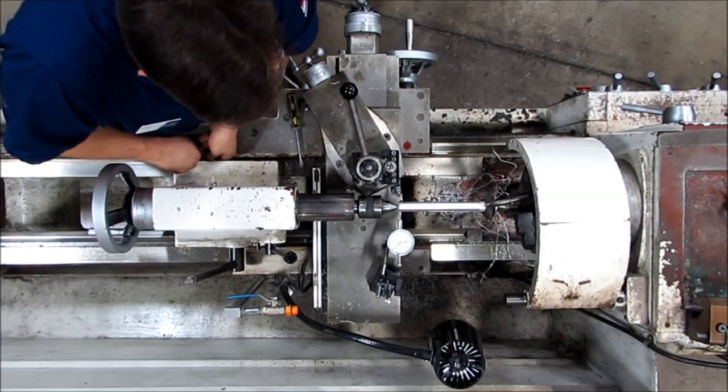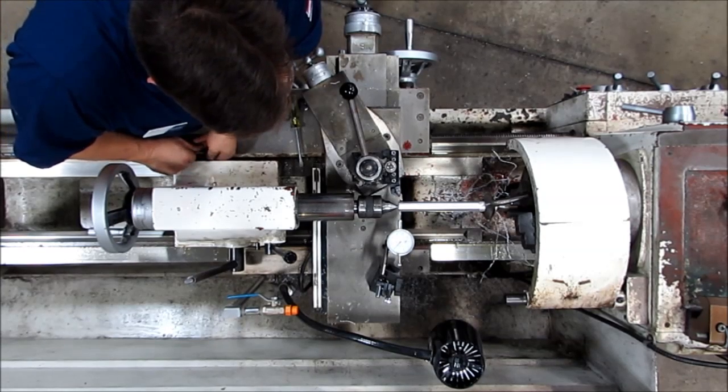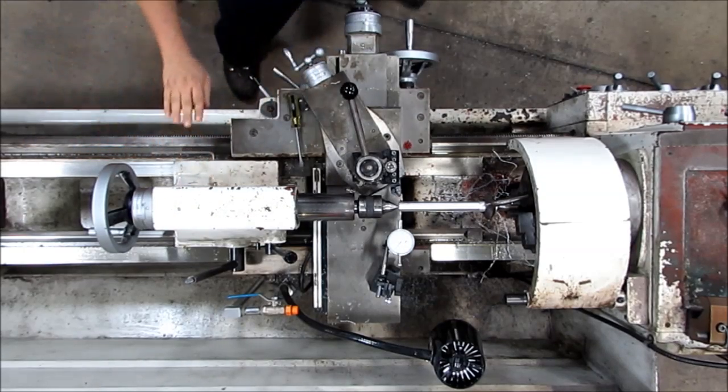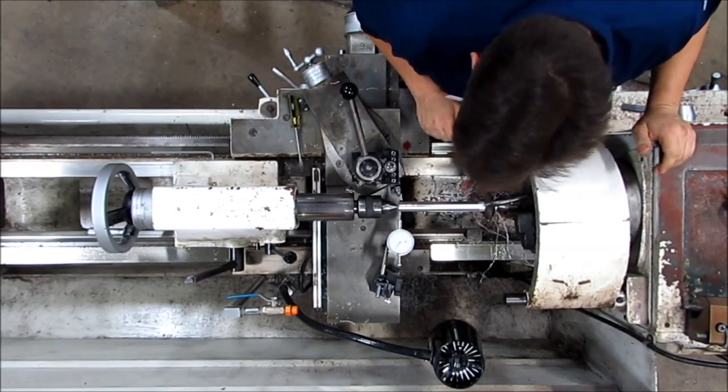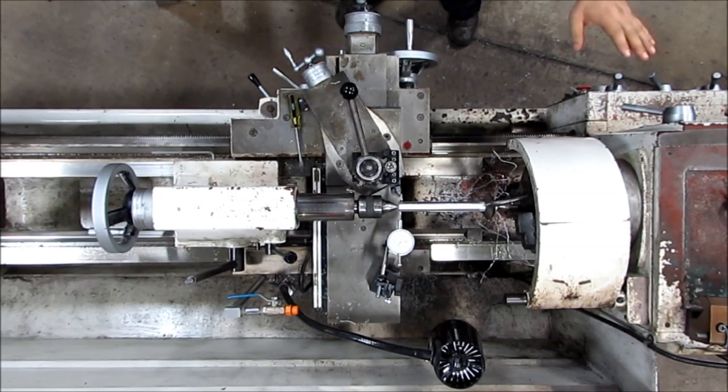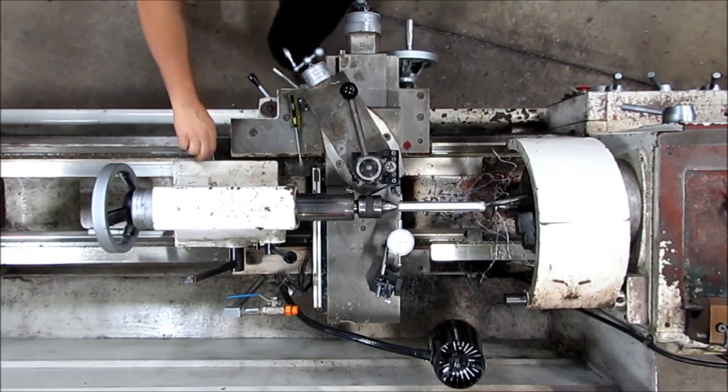You can see I'm relieving pressure — I'm loosening this screw and it's moving the whole thing back. What I don't want to do is take all the pressure off this screw, because then there's nothing to hold it in place. I don't want to do any math; I want my indicator to do all the work for me. I was at about 11 and three-quarters thousandths. I've moved it down to a positive six. That's all I need to do. I'm going to tighten these two back up.